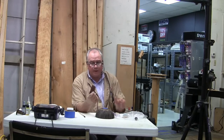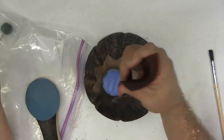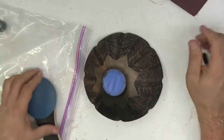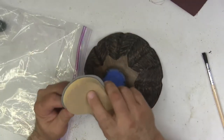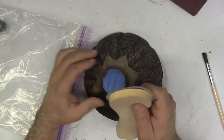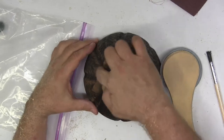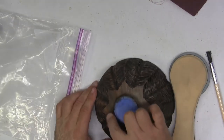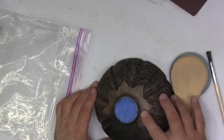This is 100 grit. These are those belts that you buy from Klingspor, the box of the scraps. And I buy those. I like it. And then I take this little hand pad here. This is 150. That is as much as I sand everything except right here along the top on the star. I'll take that sometimes up to 220.